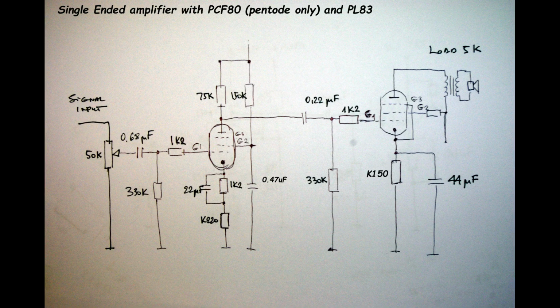A second remark you have to remember: in a tube amplifier, transformers limit everything. Maybe not everything, but like just the band of the amplifier. So if transformers are weak, you cannot do anything more. Yes, so this is the most important thing to remember. Because of that, we can make a lot of simplification and not calculate nearly anything, but we have to calculate something.